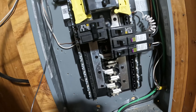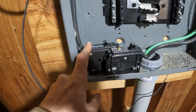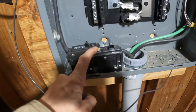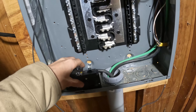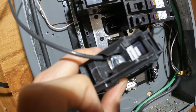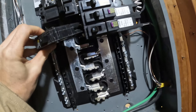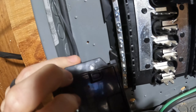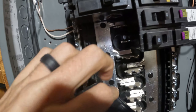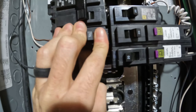As I said earlier in the video, I did originally get the wrong breaker. If you look at these two, this one is the correct one and this one is not. This one will fit the electrical box in the house downstairs, but that box is different than this box — different type of connector. Got the wire cut down, stripped about a half inch, and stuck it in the terminal connector. Now all that's left is to snap this into place. All the power to the box is off. Put the little back two feet on the rail and snap the teeth into that prong.